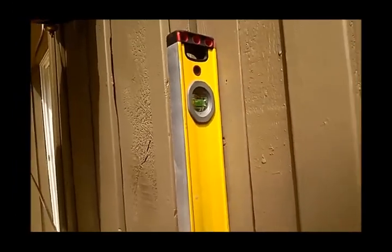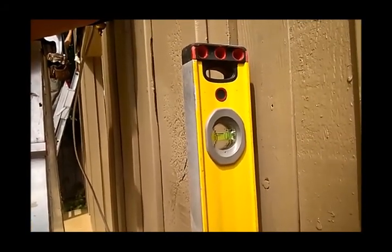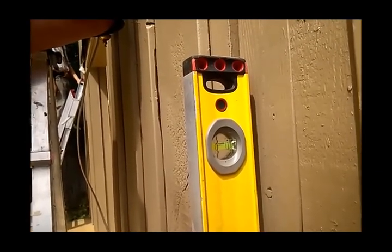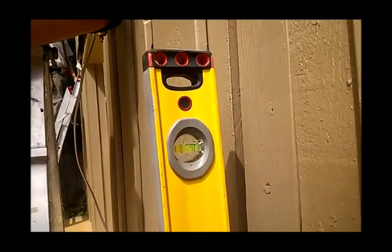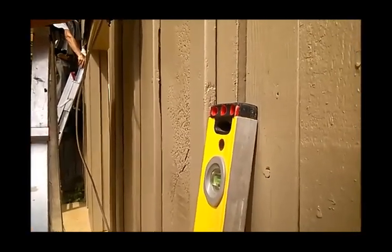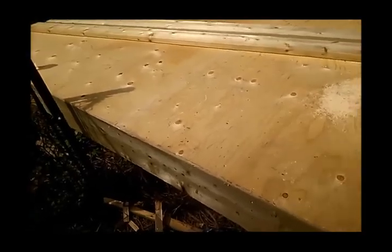Got a house that's falling away quite a bit. So when we put that 2x6 on here, we might want to shim it out at the top to keep it plumb. Then when the 2x6 all gets capped off, it'll be hunky-dory. The thing you have to watch for is when the house is leaning the opposite way into the new room, because then you'll find that the tracks that you built on the floor, if the house was tipped in an inch farther, the room's going to be an inch bigger, so you gotta watch out for that kind of thing.